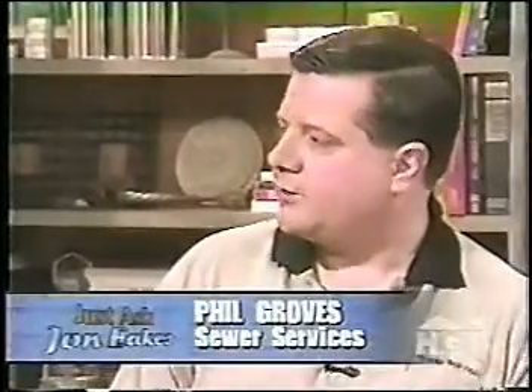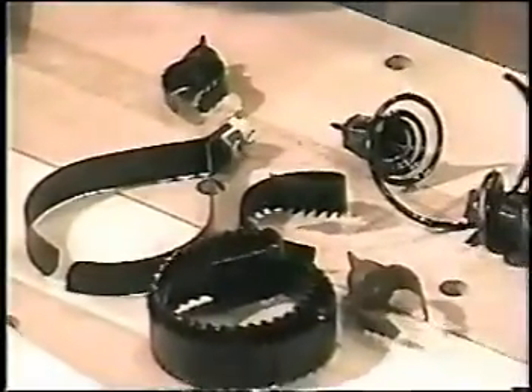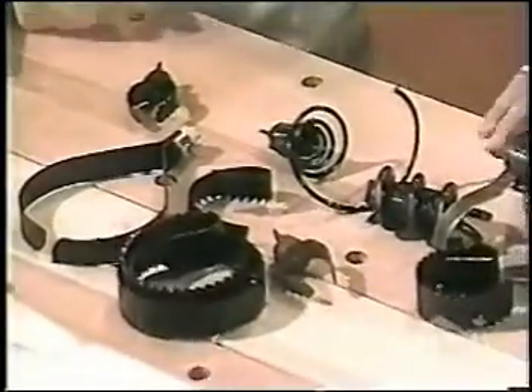And these are going to be replaced slowly with high-pressure water technology, where we can actually use water pressurized up to 4,000 to 6,000 PSI to cut the roots out. And if the roots won't be cut by water, then it can be cut with a mechanical turbine actually inside the pipe. But what we wanted to look at is a whole bunch of other technology.